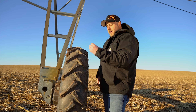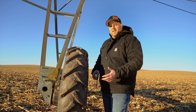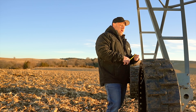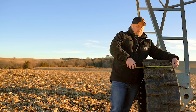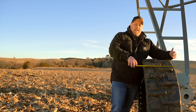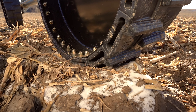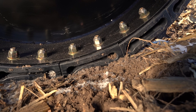That, again, is gonna cause the dirt underneath this tire to push out to the sides and give you a deeper pivot track at the end of the season. Now, if we compare this to our 14.9 EWRS pivot series tire, basically you've got 14 inches from sidewall to sidewall. It's gonna be a wider tire to start with, but the point of the story here is full width. Having a full width with a slightly in taper on the face of the tread is gonna lead to lower ground pressure, keep the mud in the middle rather than pushing it out. And at the end of the season, you're gonna have a smaller pivot track to deal with.